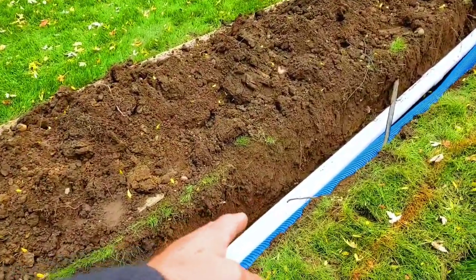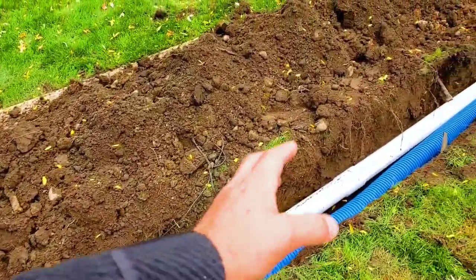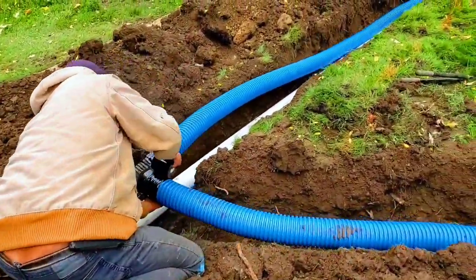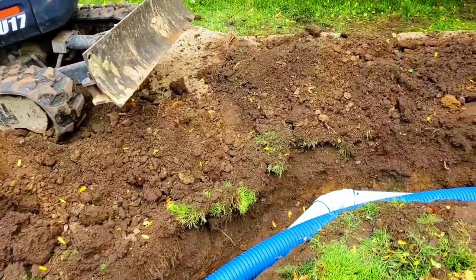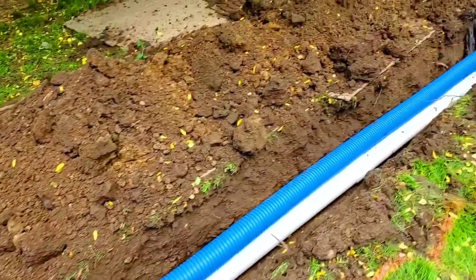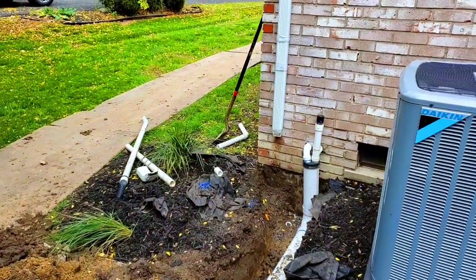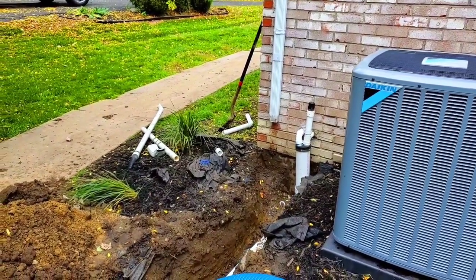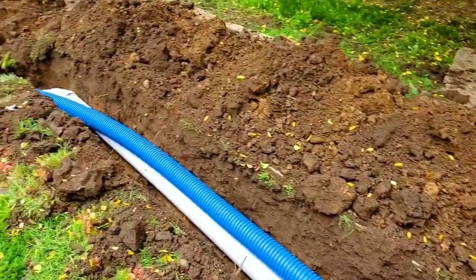So we bumped this up. This sump pump discharge line was only an inch and a half schedule 40. Only an inch and a half. It wasn't even the code minimum, which is 3 inches. The boys here, they went ahead, did a beautiful install of a 4-inch sump pump discharge line. And we even have the homeowner's backup sump tied in with the regular primary sump. So beautiful work. This crew never disappoints.